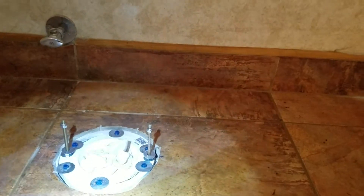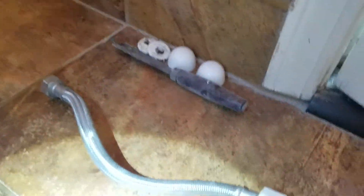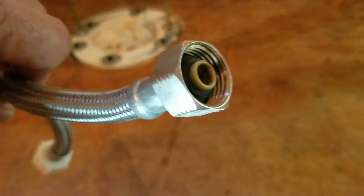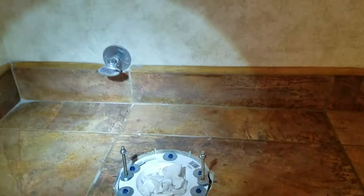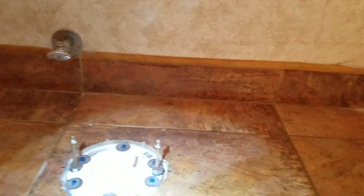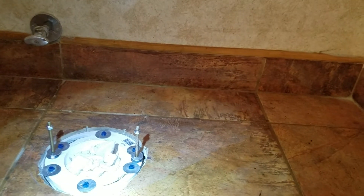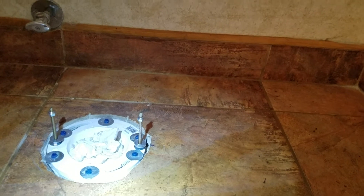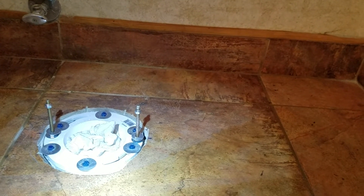They may have us come back to set the toilet. We don't reinstall old supply lines because they've been in place a while and are already pretty well worn — we don't want to put it back together and have a flooded bathroom because we used an old supply line that costs six bucks at Home Depot. So we'll get with them and see what they want to do. The glue is drying, but you could probably set it right now since those TAPCON bolts snugged up real good.